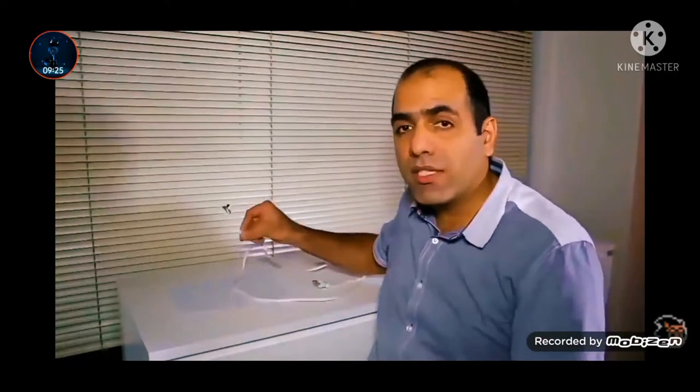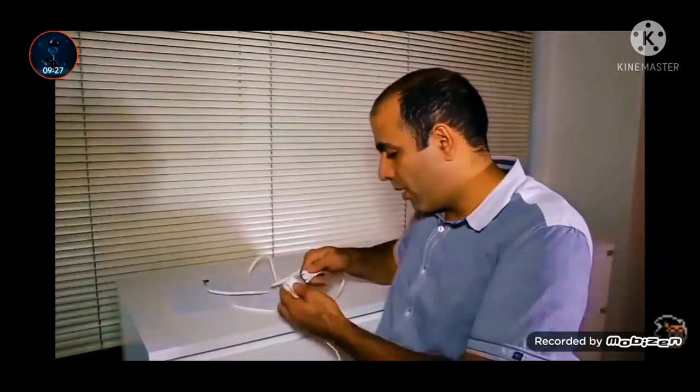Something you must never forget is that some capacitors, like electrolytic ones, are polarized and you must never connect them backwards or they'll blow up. Now I have replaced the capacitor on my circuit and I'll plug it in. In addition to polarity, the capacitors must be rated properly to be able to handle the voltage across them, or they will blow up.